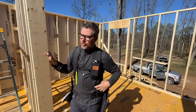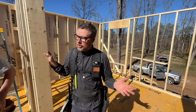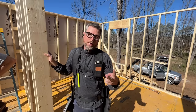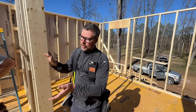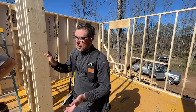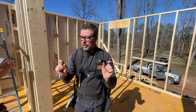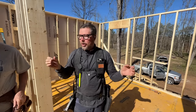We are almost done with framing walls here. I thought it would take just a second if you're interested in some of the framing dimension stuff we're doing. All of our rough openings are framed two inches over the door slab opening. So for instance, a 30-inch interior door gets a 32-inch rough opening. Then the trim will take up those extra inches and we'll have a little room to shim. But the headers that run across the top of the jacks on those openings are another three inches long.